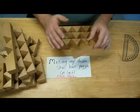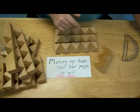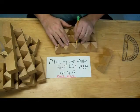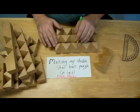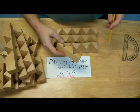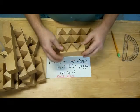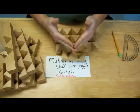With all of these notched burrs that I've shown you, between each notch, I left about 1/16 of an inch gap. Right there, there, and there. And of course there, and all the others. Now, at the end, the inside of the notch, there is no gap. Those cuts come and meet right up to each other.